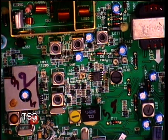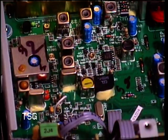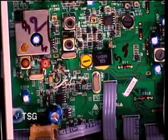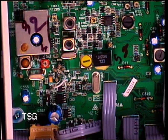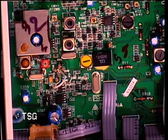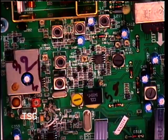And I think that covers everything there is on the radio. It's receiving very well. Just go back to where we were: 0.15 of a microvolt, 0.16. That's very good. Of course, the proof of the pudding will be in the eating, as they say.